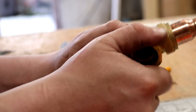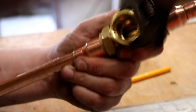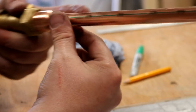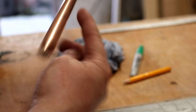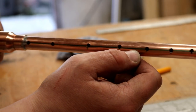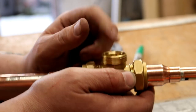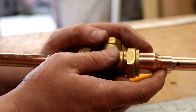Folks, what we've got here is the assembly for the sparge arm, the rotating sparge arm. So if I take this off, you'll see that we've got holes pre-drilled, same on both sides if I flip it round. So they're every 10 mil to start with. We need more water on this edge, and then this spaces out to about 40 mil as it approaches the center. We're coming in with 22 mil copper pipe fittings and then stepping down to 15 mil.